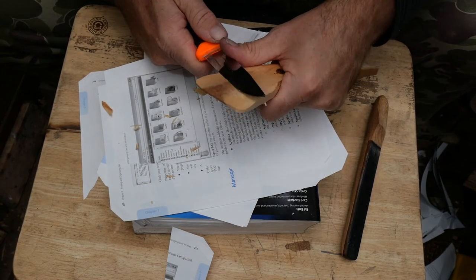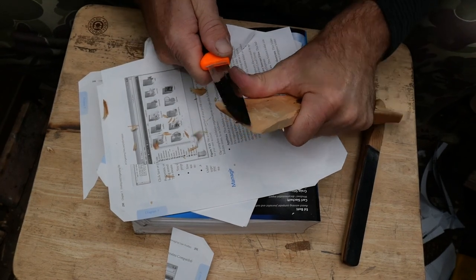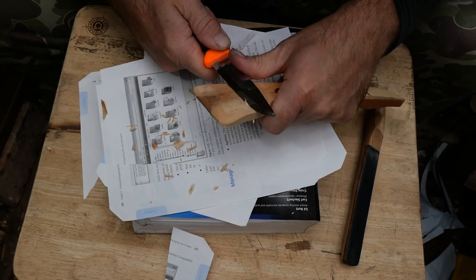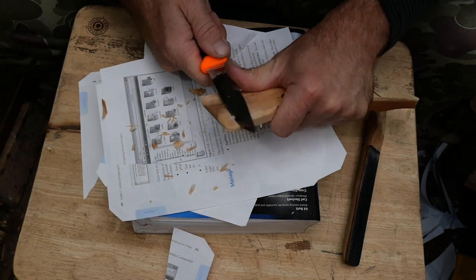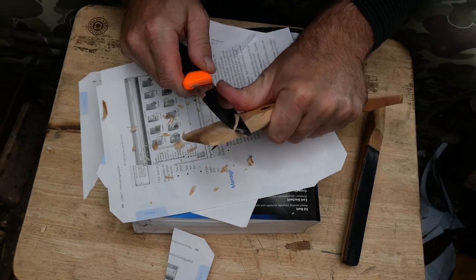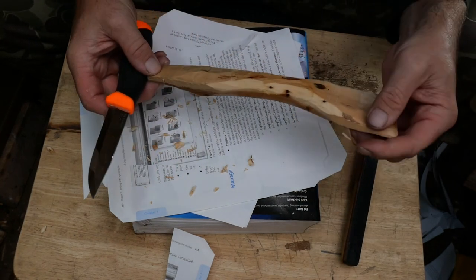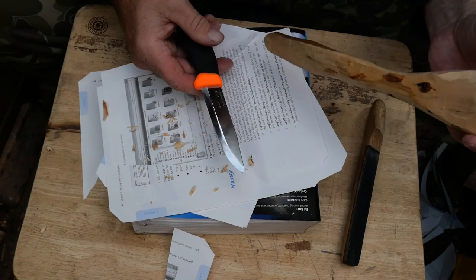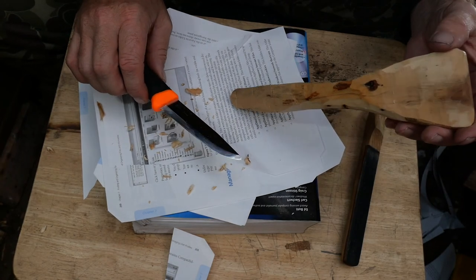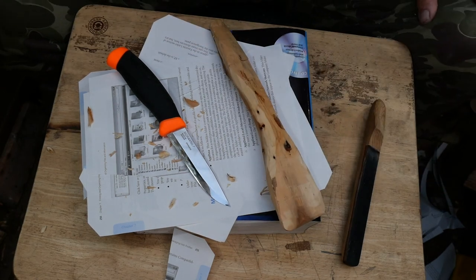And that's the way I would maintain this knife — just keep doing that. As soon as you feel any sort of edge slightly losing its bite, keep it topped up with polish just like I've shown you there. Do a bit on the sides, brush past the edge, then go steep, very gentle, polish off the edge. And this will do a lot of carving before it needs to go back to a stone. That's the art of stropping — to be able to maintain the edge to a high level with the strop, and not go back to the stone, getting as much wood carving in between strop sessions as you can.